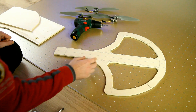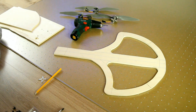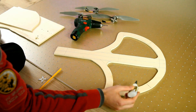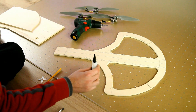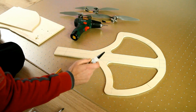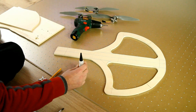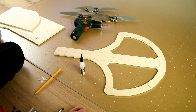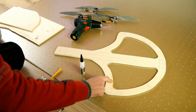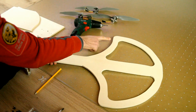There are a few places — not that many really — where the top layer chipped off. What I've done is on every place that happened, here and a few tiny places here, here, and here, I've dropped a drop of CA glue — instant glue — on there. It's about the consistency of water, a bit thicker, but it drains into the wood and when it hardens it's really hard.